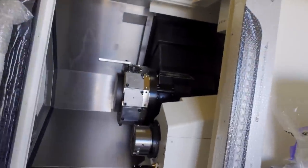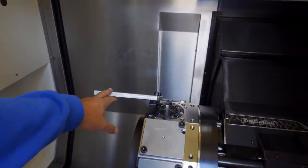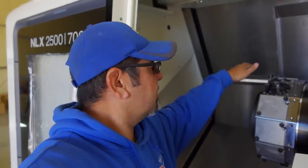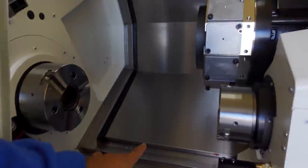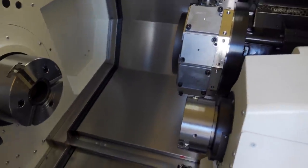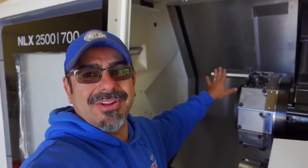I'm back at the lathe while Mike takes a break. I noticed he has a plate here — I asked him what it was for and he said that's how he levels the machine. He bolts the plate down and levels the machine in every direction from that plate. That's how they level it since nothing on the machine itself is flat — live and learn.